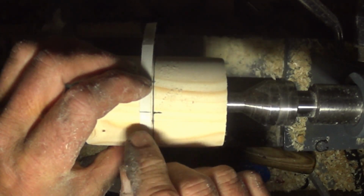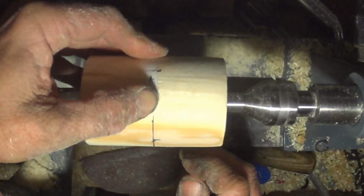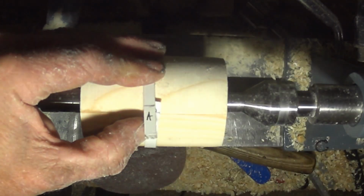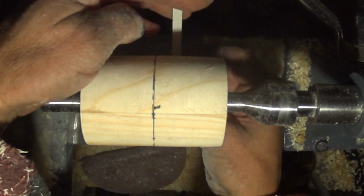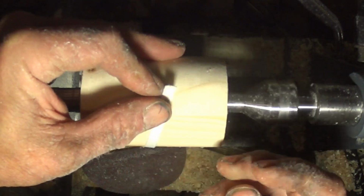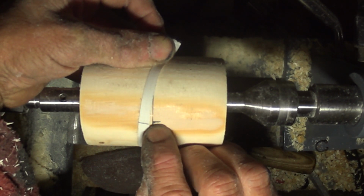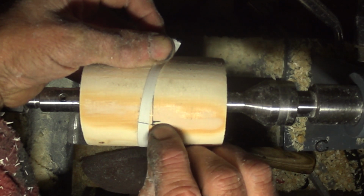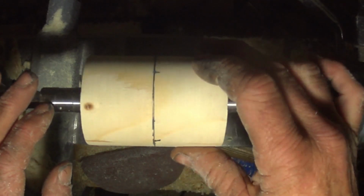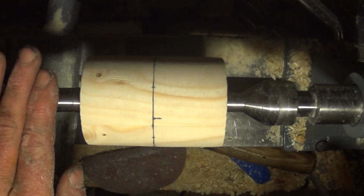Find your half division. Oh no, what we're going to do, sorry, is we're going to label these A and B. So you can see I've wrapped it that way round. If I wrapped it that way round and the circle's smaller, you'll get two sets of lines, and the centres of those two lines would be exactly the right thing for whatever size that you've gone out by. So it's just a way of correcting an error in size. So that's your first ruler, it just divides it into 4.